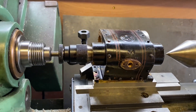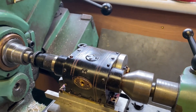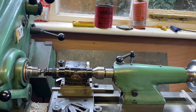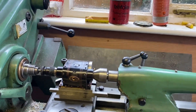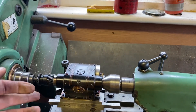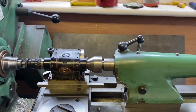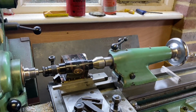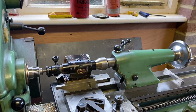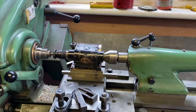I will then clamp the block down and take these away. What I've done is shine a light around here and look in the end, and vice versa, so that I can see that it's running true. So it's mounted true to the two centers - best I can do at this stage with what I have available.